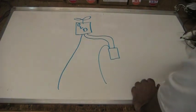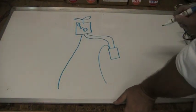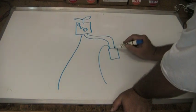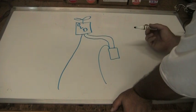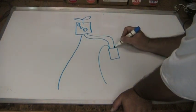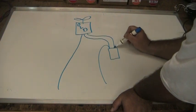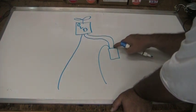The third wire goes off to a circuit board, contactor, or terminal block — wherever it happens to go. On this little capacitor there are two wires from the fan motor, and we need to determine which one is the capacitor wire so we can eliminate it. It's very simple: the capacitor wire sits on the terminal all by itself. There's one wire on one terminal and two wires on the other terminal, so the wire by itself is our capacitor wire.